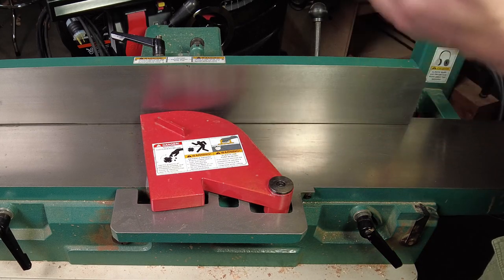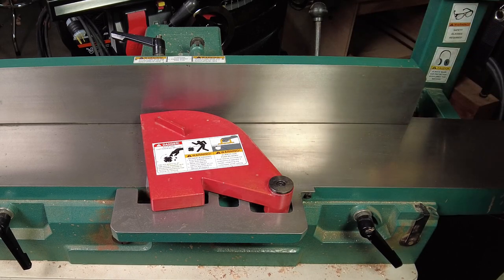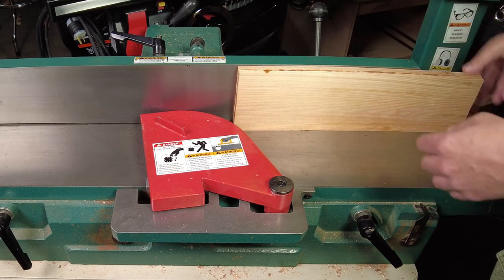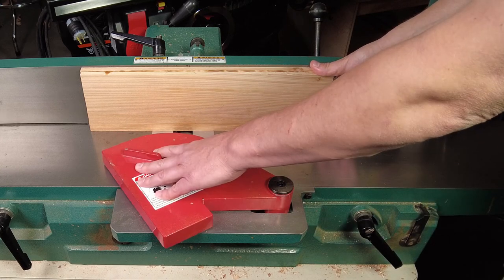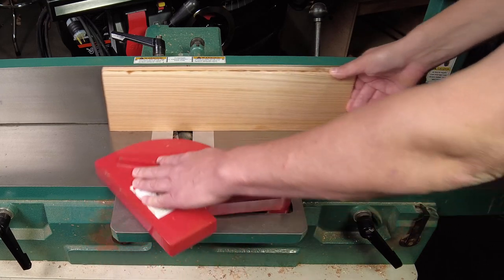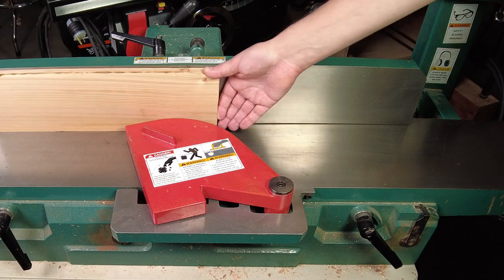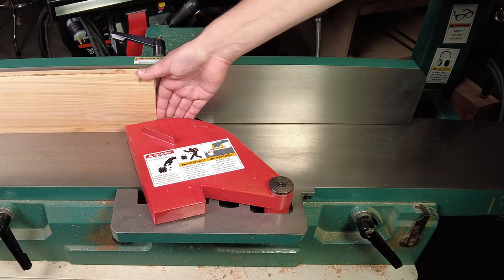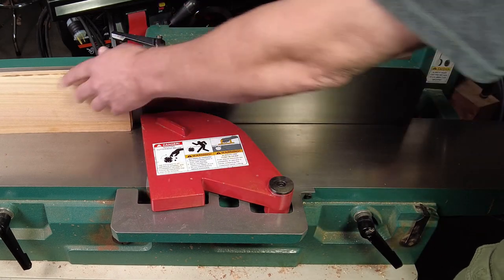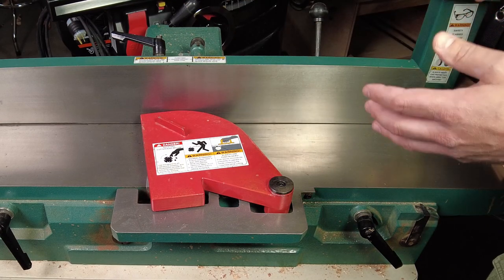I thought, it's just a couple of quick cuts — I've done this a million times. Well, that's when bad things like this happen. So don't ever say to yourself, 'just a couple of quick cuts.' My hand was too low, and the cutter guard was hanging open. Would the cutter guard have saved me? Probably not, because the way I was feeding the board, my fingers were right in the path of that cutter head. It may have made my injury not quite as severe, but I don't think it would have saved me altogether. That's what I did, and that's how I made my mistake.